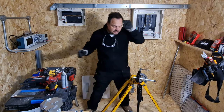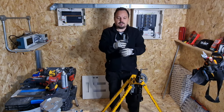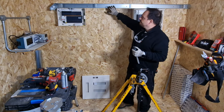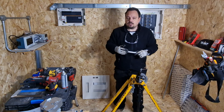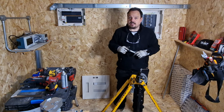You can see that went through nice and easy and we've got a really flush cut on the end, so that's nice and flat ready for us to thread and get into this trunking up here. We're going to thread a nice end onto this end, couple it into our metal clad back box, and then we're good to go.